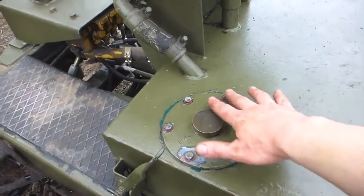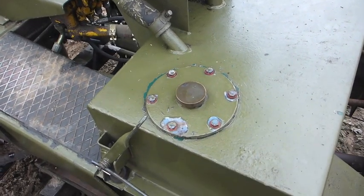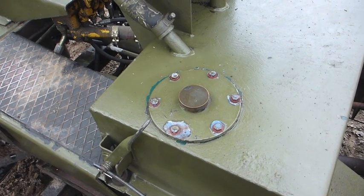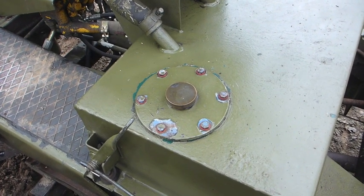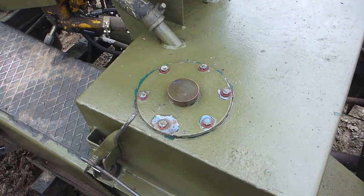Hydraulic tank. Inside, if you remove this cover, is the hydraulic suction strainer. They are no longer obtainable from Thwaites. It fits onto a 1 inch BSP thread. It's very common to find them either removed entirely, or people punch holes in them when they block - because that would fix it, wouldn't it?